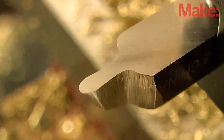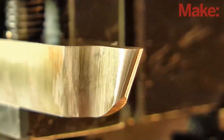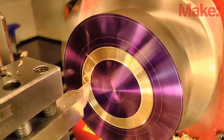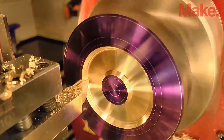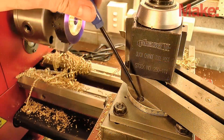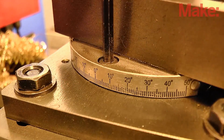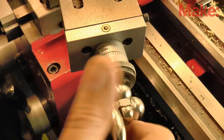This is the cutting tool we're going to use to form the recess in the flywheel. Its shape means we can use it to cut both left and right, and it's also got a lot of clearance on the front and sides so that it doesn't rub on the sides of the recess as we cut. Set the tool on center and begin by removing the bulk of the metal in the recess. When you get close to depth, rotate the top slide of the lathe to 20 degrees and start forming the outside tapered shoulder, this time by feeding in with the top slide handwheel.